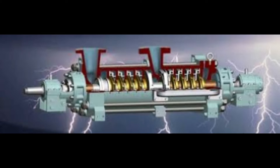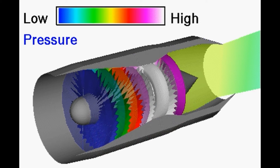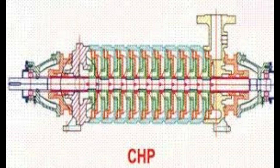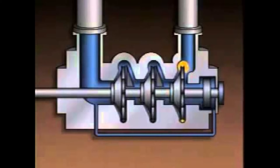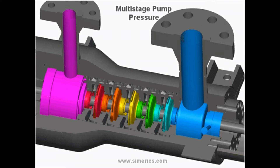What is a multistage centrifugal pump? A centrifugal pump containing two or more impellers is called a multistage centrifugal pump. The impellers may be mounted on the same shaft or on different shafts. At each stage, the fluid is directed to the center before making its way to the discharge on the outer diameter. For higher pressures at the outlet, impellers can be connected in series. For higher flow output, impellers can be connected in parallel.